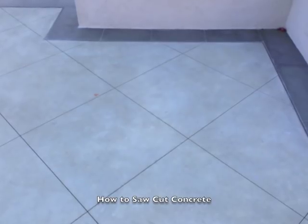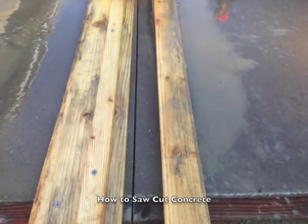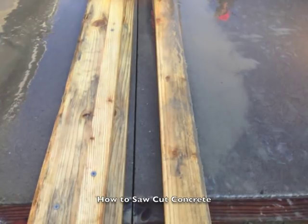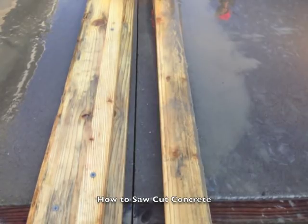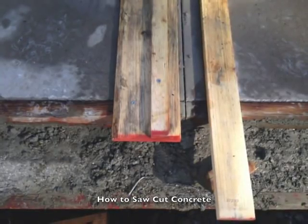The other thing you'll need is a jig, as shown here, to control the saw and get a straight cutting edge. This one was made with two 1x6s. One board was ripped down to about 2 inches wide and became the edge to run the saw against. The second piece was used to float free and provide a level surface for the other side of the saw. Wood screws were used to connect the pieces.